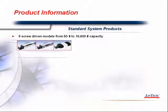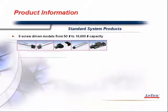Lintech's most popular series is the 170 series. This utilizes 2 rails and up to 6 bearings for a carriage. It is available with top or side aluminum cover plates and way covers as well. Many Acme and ball screw options are available to customize for speed or repeatability requirements. Dynamic loads with a 12-inch long 6-bearing carriage are up to 8,400 pounds.